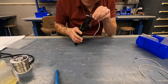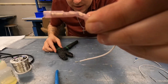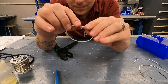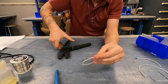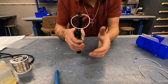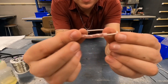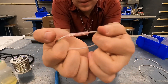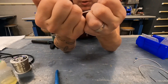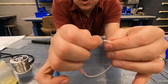Put this on here, hold everything snug, and give it a good old squeeze. It is now crimped down. Manipulate the other side — same thing. Take your time, make sure you get everything lined up. There's a butt splice done on a wire. This would work in most of your installations. You should be able to tug on it with a little bit of force without it coming apart.